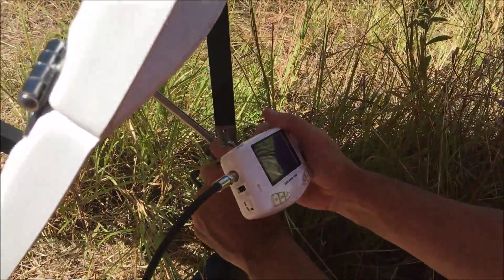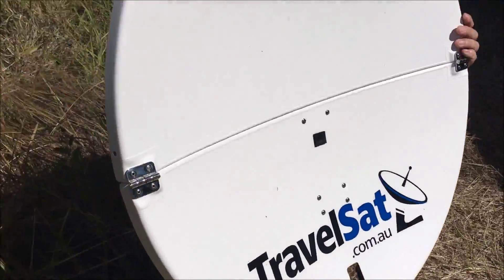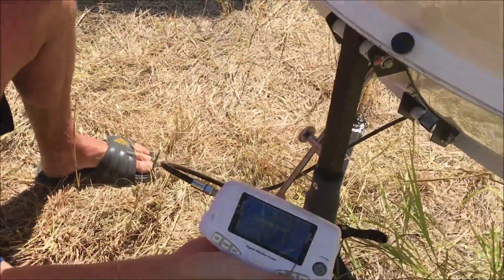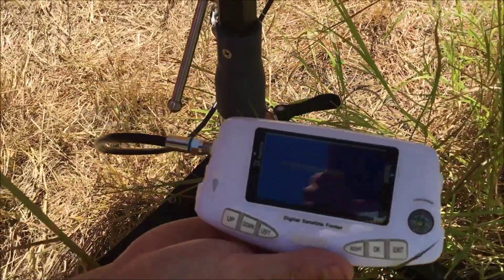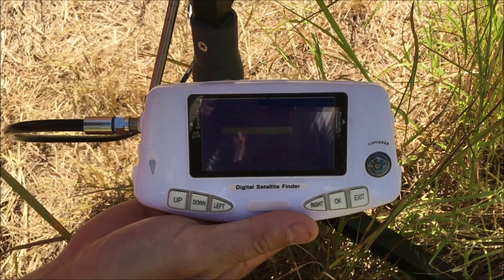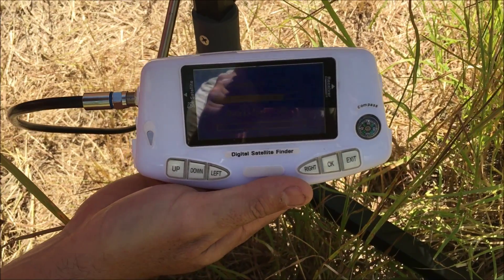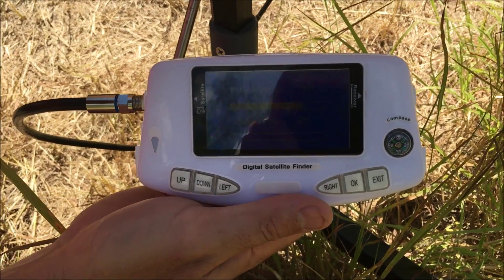While I do that, Sam's going to go around the other side of me. Okay, so we've totally moved the dish out of alignment. You can see on my digital satellite meter that I've got a signal strength reading but no signal quality reading. When it comes to aligning a satellite dish, signal strength is almost irrelevant — the most important thing is the signal quality.